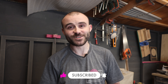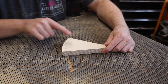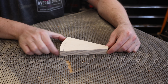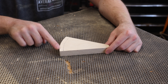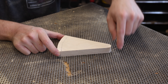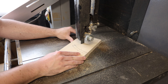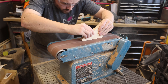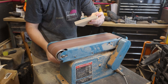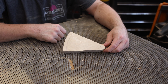The shelves are going to stack and form a spiral. I've gone ahead and cut one shelf to use as a template for the others. It's got a couple of straight lines — a bit like a pizza slice — with a larger curve towards the outside and a tighter curve on the inside. I've also marked where I'll add an 8mm dowel later. I cut it on the bandsaw, sanded the flat sides flat on the belt sander, completed the shaping on both curves, and can now use it to trace around and cut the other shelves the same way.